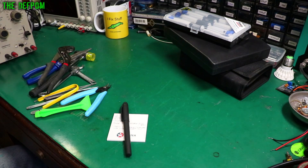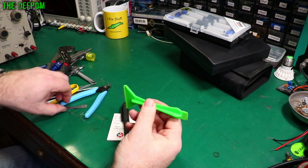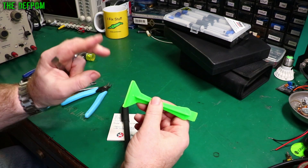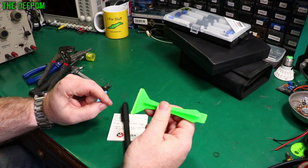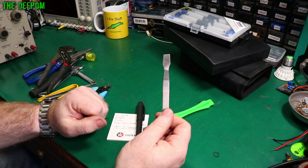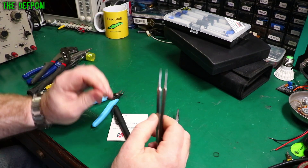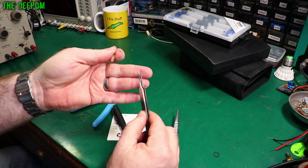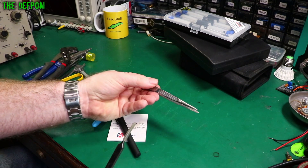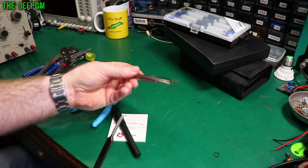You always need a knife. Spudgers — you need spudgers, both plastic and metal. If you're worried about damaging the surface or scratching the joint between two parts, you need plastic ones. But sometimes you need metal ones because you need to be more robust and the plastic ones just won't survive it. Decent tweezers — you need some quite robust tweezers sometimes, and also some really fine tweezers for surface mount work. These have really fine tips — don't stab yourself with them, they hurt. I've had these particular tweezers for 30-odd years and they're really good. I wish I could get more exactly like them.